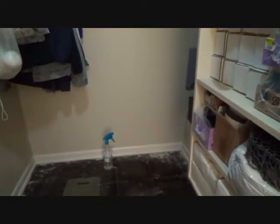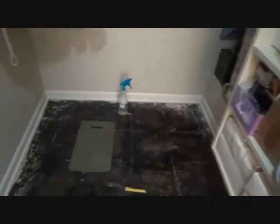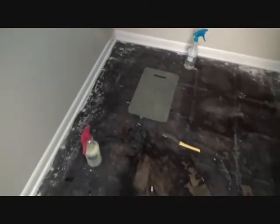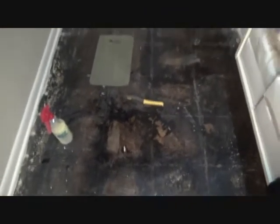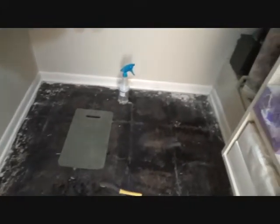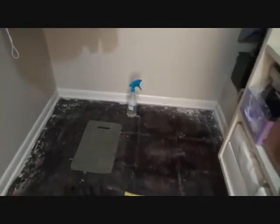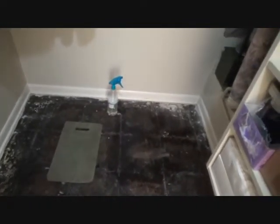I think it will stick anyways because the black tar was installed with a trowel, and you can see all the trowel lines — that will help the underlayment material stick to the floor. But even doing that, that's going to be a lot of work. Putting the underlayment on means I have to install masking tape all the way around the baseboard because I don't want to get it on there. There's no lip because it went right down to the floor. Usually with carpet, the baseboard would be installed about three-eighths to half an inch above the existing floor line, but here it goes all the way down.